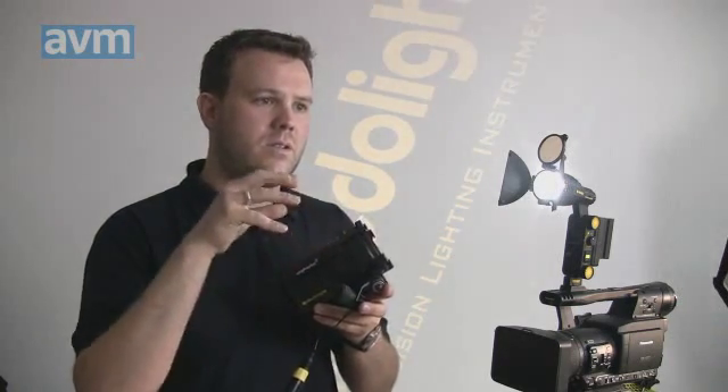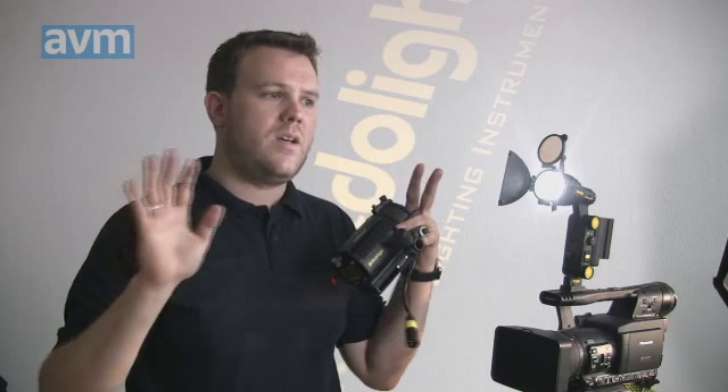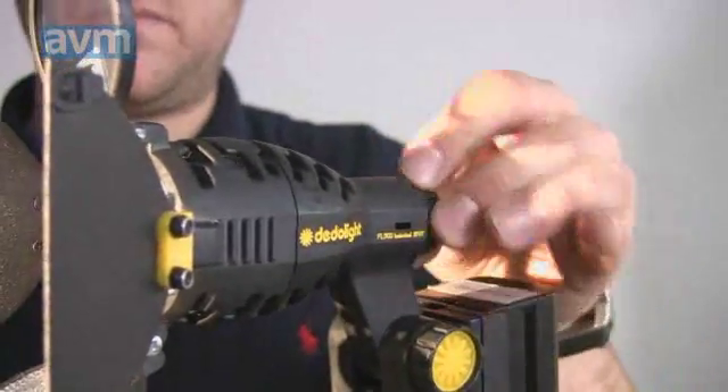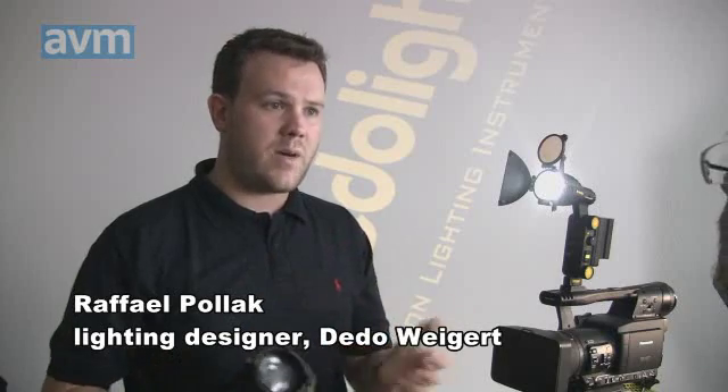We tried to find an LED light source that we could use to basically make a smaller version of the classic dedolight. For that we need a pointed light source, and we looked for a very long time and finally found a 6-chip Osram LED. Because we need a pointed light source to have a focusing range — from 60 down to 5 degrees, using a diffusion lens to open it up a little bit more. There's no other LED light on the market and very few other onboard lights that can be focused. Imagine you're the only cameraman with an onboard light that can be focused — you might be able to shoot the queen of Denmark on the balcony when everybody else simply doesn't have the power to focus their lights. So you make money at the end of the day.